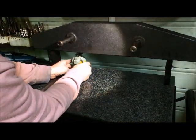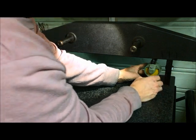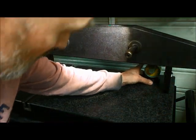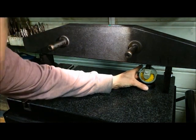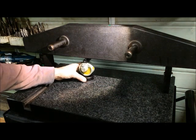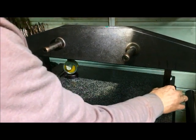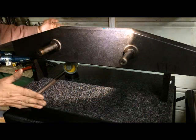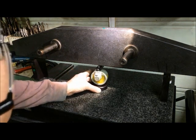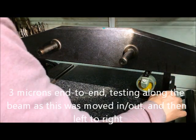I set zero over here and see if it repeats, otherwise I will adjust the height. Then I slide it a little bit like this, measure again, and slide it all across to that side, taking readings until I've covered the full width, then repeat the other way. I managed to sweep, set zero at the ends, and get it to two or three microns from end to end both ways.